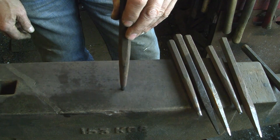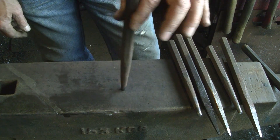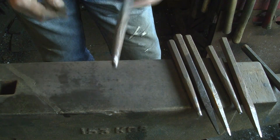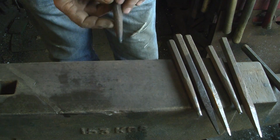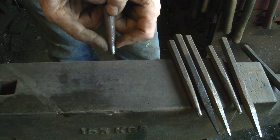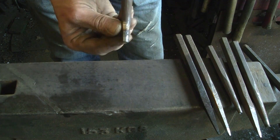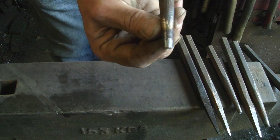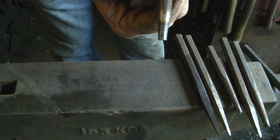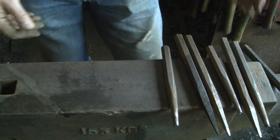The secret to a good punch is when you make it: the last knock - hold it upright, not off to one side. Make sure it's perpendicular to the anvil and give it one good hit, just one - that's all you need. What that does - I don't think you can actually see it on here - is just slightly flares out the bottom, just a touch. It makes the bottom just slightly wider than the rest of it; it just stops it binding. It's just got a little tiny bulge on the end that stops it binding and usually knocks out a nice clean blank.